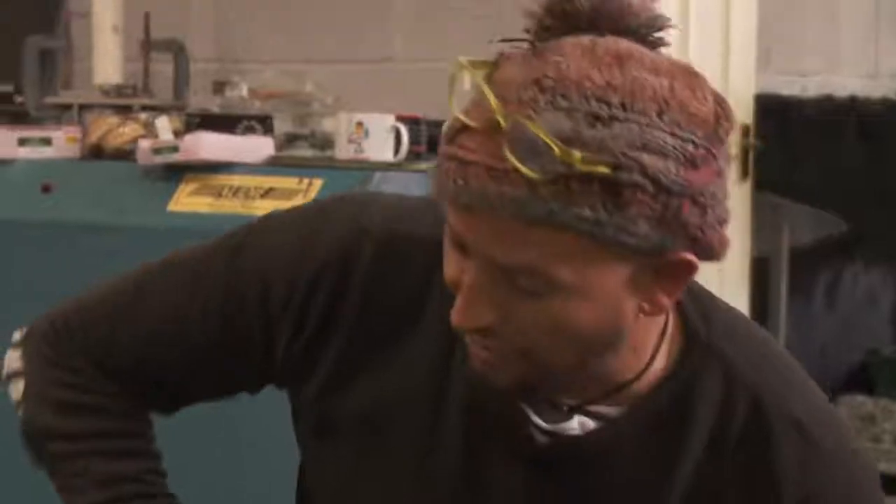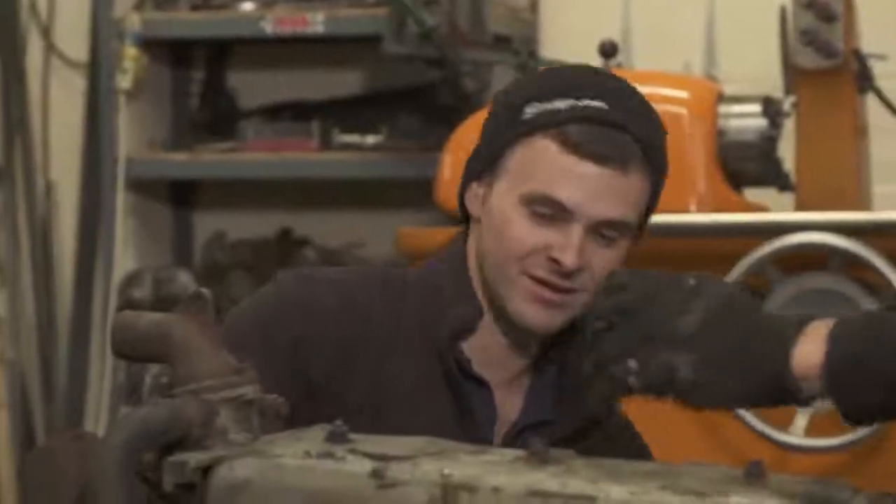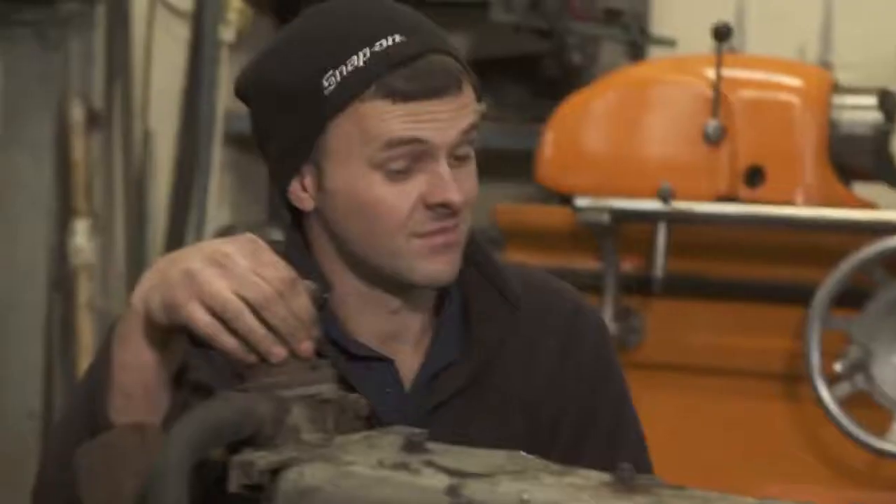This is a diesel engine, but not all tractors run on diesel. Some of them started off running on petrol and they used to turn over to TVO — tractor vaporisation oil — or paraffin, actually. People used to run them on paraffin. They'd start on petrol because they'd start easily on petrol, and then once the engine had some momentum and it was spinning and warmed up slightly, switch it over onto paraffin, because paraffin was cheap — cheaper, more available. Probably rougher running and with much lower octane, so it didn't burn so magnificently. However, it was cheap, so just run them all day on that.